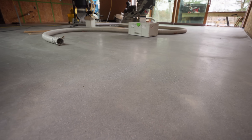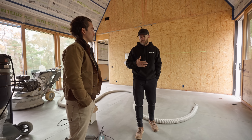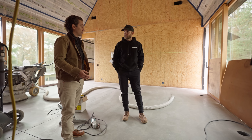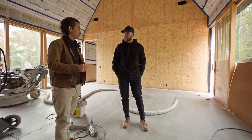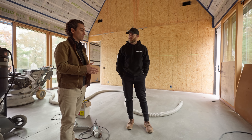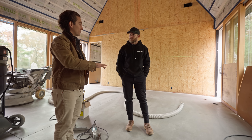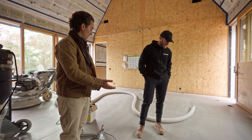One of the biggest benefits of this system is our floor finish. Let's go inside and look at that specifically. Architecturally finished concrete is something we love, but it's very expensive and requires a lot of finesse — typically a topping slab with a specified and tested color mix. On this project we were optimizing for all the constraints, aligning design intent and budget. With the frost protected slab on grade, this is the structural slab, and all we did was specify how to cut and polish it.